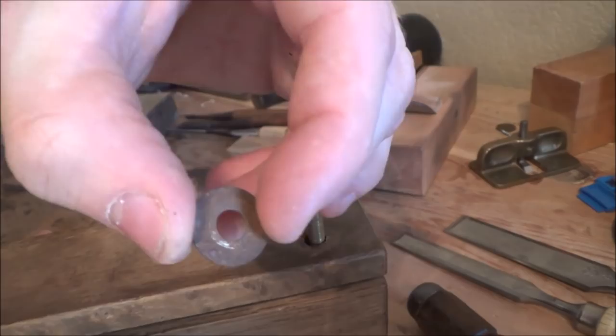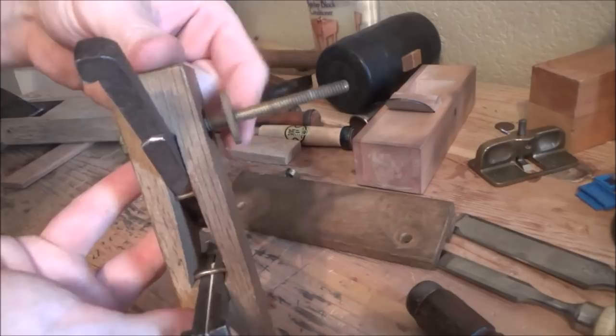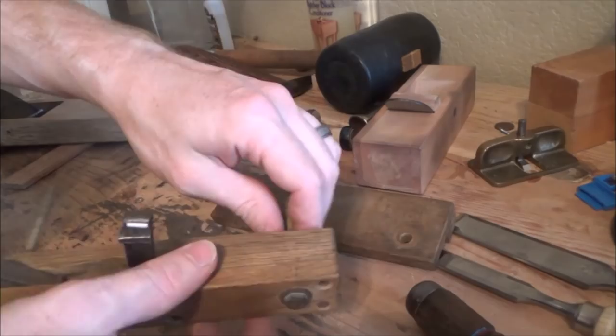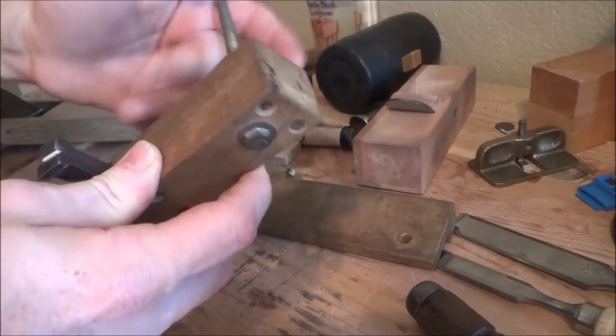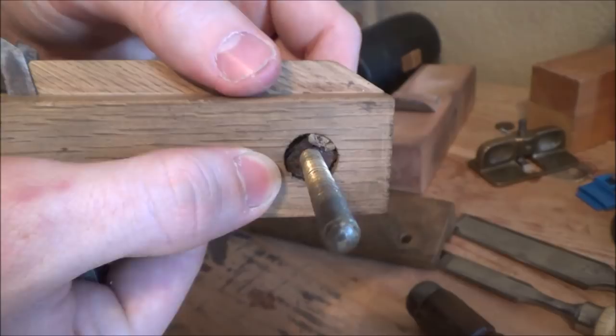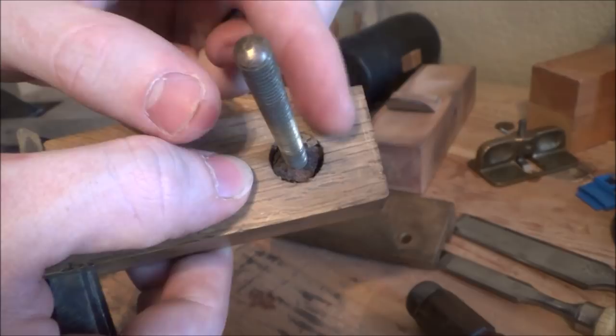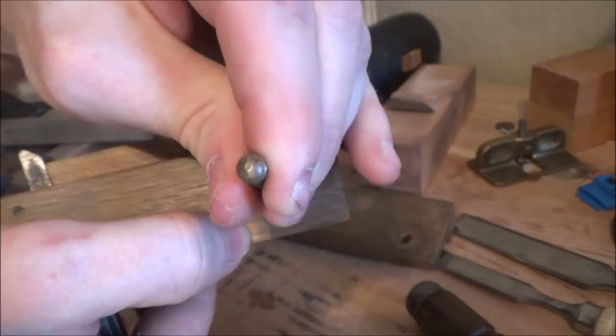The fence comes off like this. Once I retrieved the washer that ran away from me, the fence comes off. To lock the fence where you want it, you have these little thumb wheels on the inside. Now check this out — the holes here that actually lock this in place. If you've ever heard the term 'trying to fit a square peg into a round hole,' this kind of is the definition of that. They actually took a square nut, hammered it into the hole, the teeth bite into the circle, and keep this from spinning around when you're putting the parts on it. That is actually kind of clever.